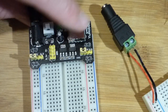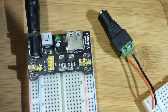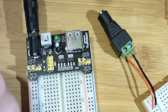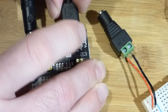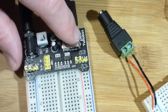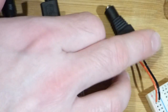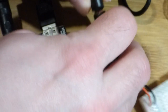We're going to power it with this breadboard power supply. Let's grab the adapter — it has this output for the power supply. The power supply can input 2 amps maximum, though you don't want to do that all the time. The breadboard power supply is limited to I think 0.7 or 0.5 amps — something like that at 5 volts. You want to look at the specs from the manufacturer. We plug that into there, and the other side of this converter we plug into the barrel jack. And we should be good to go.